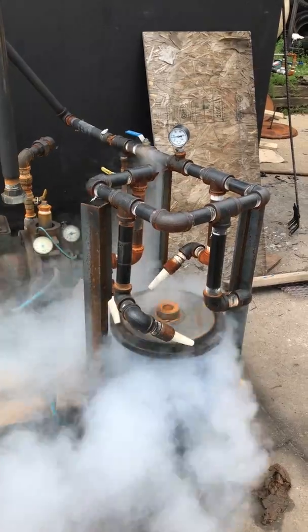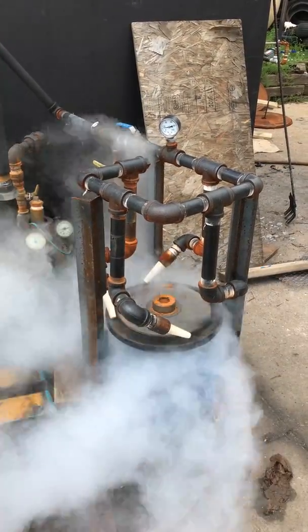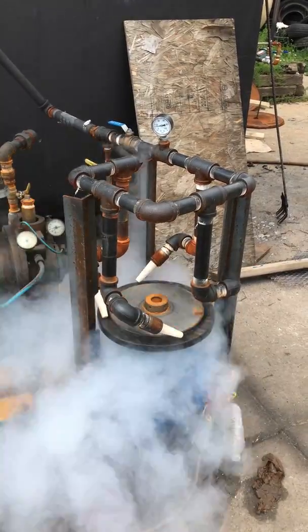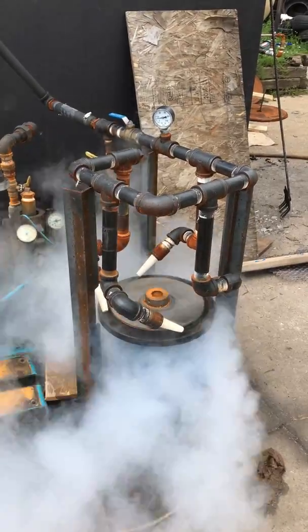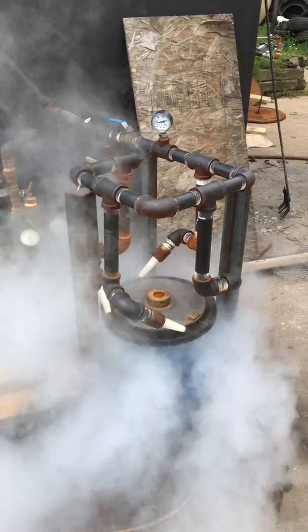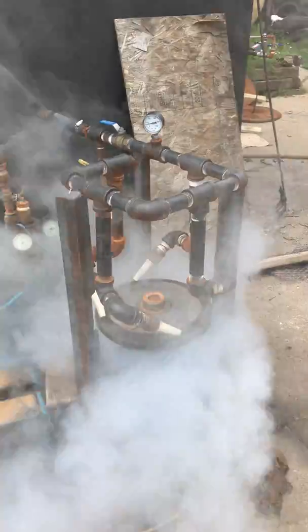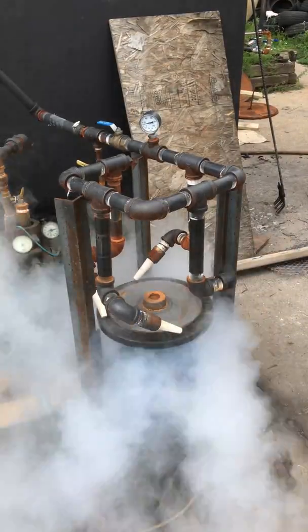We have a regular three-phase motor — it is a 1200 RPM motor. We're not running anywhere near 1200; it is currently at 486 RPM. We're running this at probably 250 to 300 RPM to get that 162 volts DC.